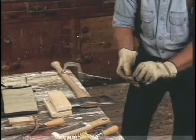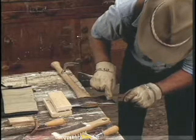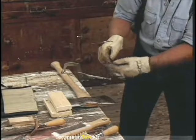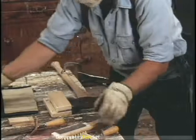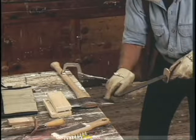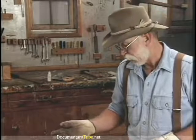So I'm going for this 25 degrees right here, except it's a little too thick — it's too thick back in here, so I'm going to have to file the cheek off some. It's not a straight 25 — it shouldn't be a straight edge, it should have a slight curve to it. The finished shape is going to be a half moon, with it filed more back here into the cheek. Now remember, I'm not just sharpening this — I'm rehabbing this axe and then sharpening it. If you take care of your axe, you can touch it up in 15 minutes with a file and the stones, but when you're starting over with one, it takes about an hour.